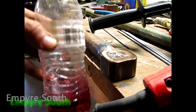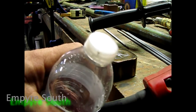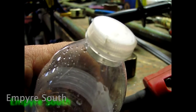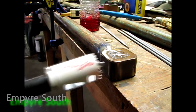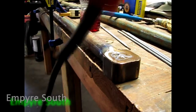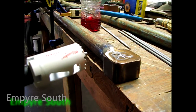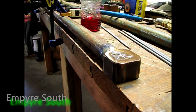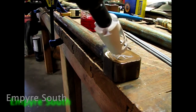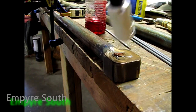So I got my transmission fluid. I just drilled a little hole in it. I recommend using a bi-metal hole saw just because you're going to be making a lot of holes. And with this, you don't want to put a lot of pressure on it because you're going to end up dulling the blade.